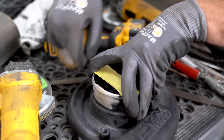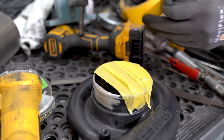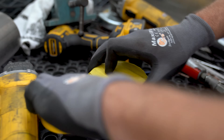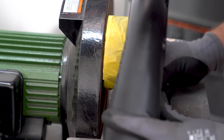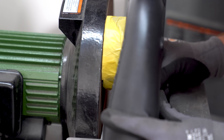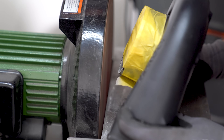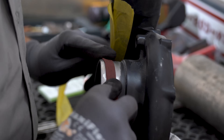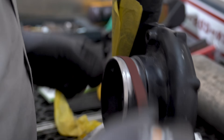To face off this repair, I opted for a quick but kind of risky solution. I started by taping off the sections that I didn't want to get faced. It's not the strongest form of defense, but it actually helps prevent quick little nicks and unwanted accidental scratches. The repair area left exposed will be faced with my disc sander. I tried to get it as close to flat and level with the rest of the inlet face as possible, so that if I need to take any more off, there will only be a tiny bit left with a file or flap drum. Finishing off was just a matter of chasing out any little details or tiny imperfections, and I got rid of the heavy file marks by brushing it over with a piece of emery cloth.